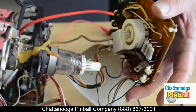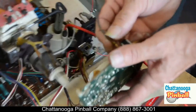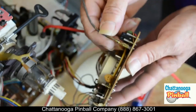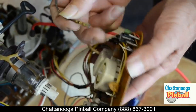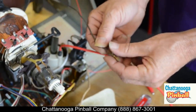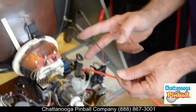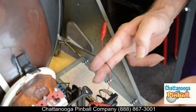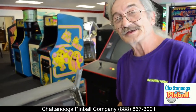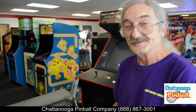Coming from the tube itself is usually a ground that's connected — those need to be disconnected. The newer monitors and these old Electro-Homes simply unplug. Some of the older Wells Gardners are actually soldered in place, so before you send it in to us, you can go ahead and clip that wire right there — just take a simple pair of cutters and clip the wire. We'll put a connector on it and send you the other end so that you can reconnect the tube.